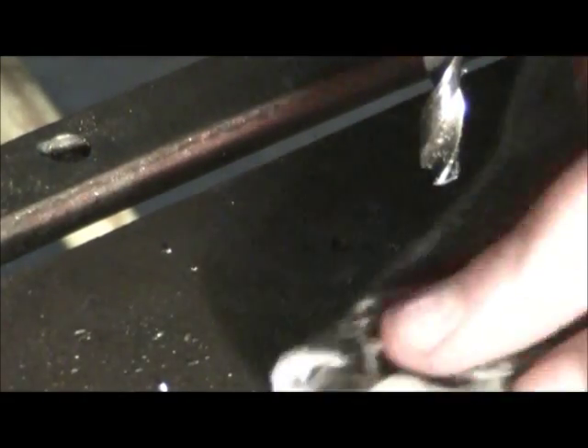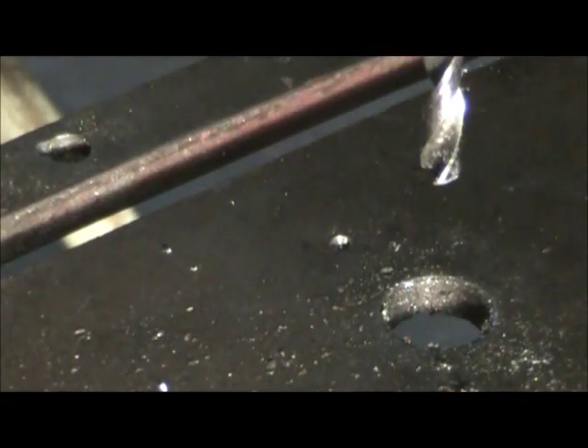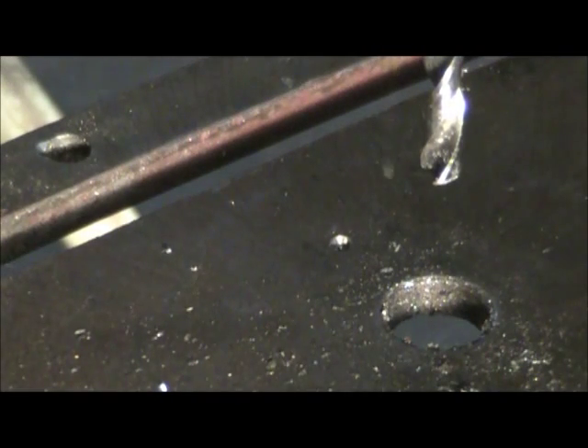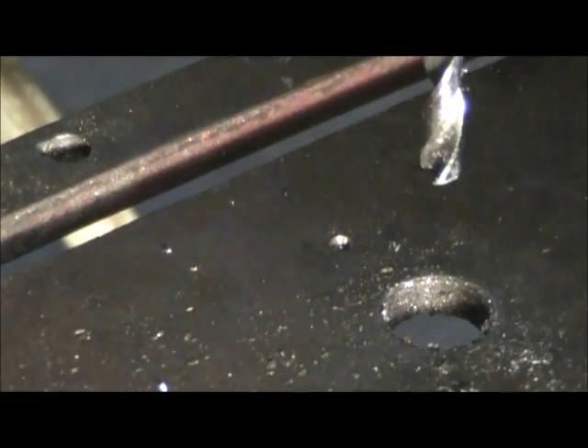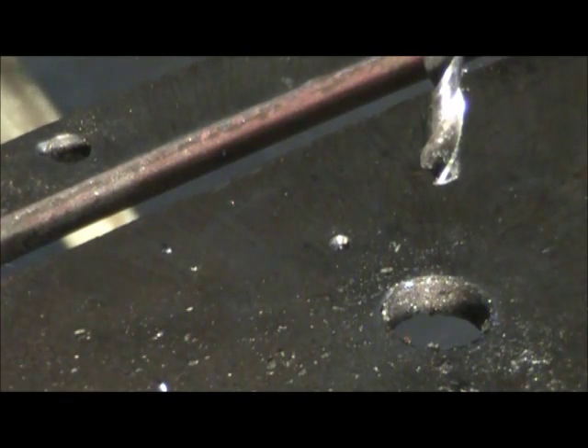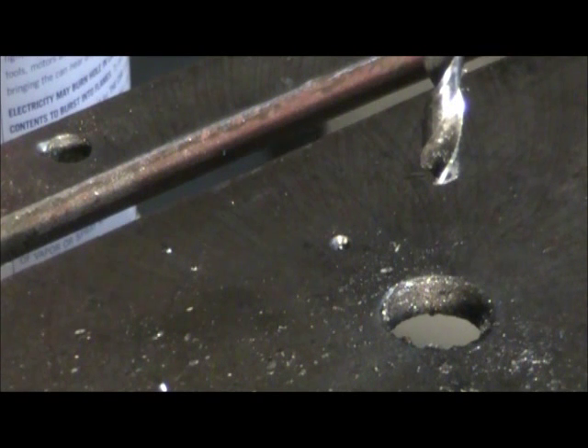See those little swirlies I was talking about? It didn't get a little oil at the end and it started to squeak and make some noise — if you hear that, you just want to take it off and put a little oil on it. But here we got a nice clean hole, fairly centered.